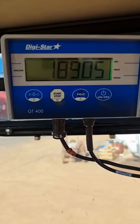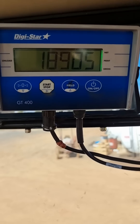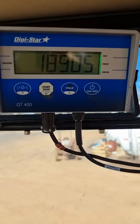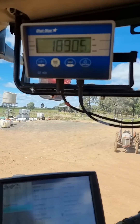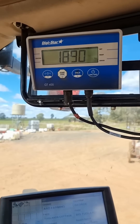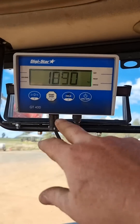Now in relation to doing a further calibration if you found it was slightly out — what we do is divide our known weight by our displayed weight. So say we've taken 30 tonne out of the bin but it could be reading 28.9 tonne. If we want to make that 30 tonne, we divide our known weight by our displayed weight, and that'll give us a new calibration figure. That figure might be 19,265 or something like that, so then we'll put that in there.